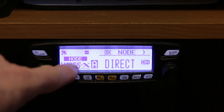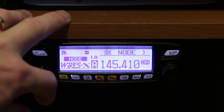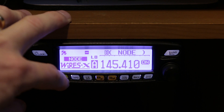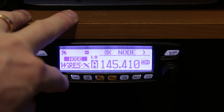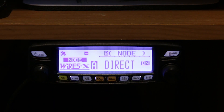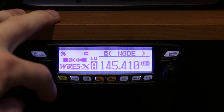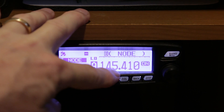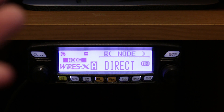You can see now that the Wires-X node says 'direct.' What I was having a hard time with was the boot-up procedure. The instructions showed to push just the DX button and power it up, and it came up in PDN mode — that's what was confusing me. Finally I realized it's all in the instructions, just hard to understand: what I wasn't getting was the three-fingered DX+GM boot-up to get 'direct.' I could go from actual frequency to direct by hitting the AB button in PDN mode, but it just wasn't working.